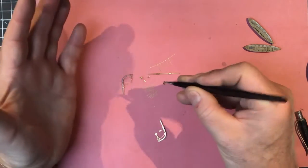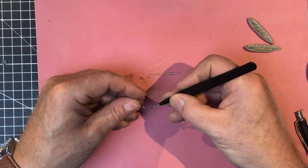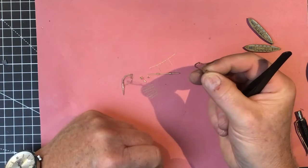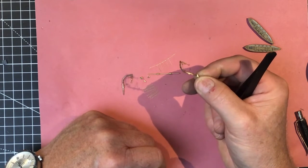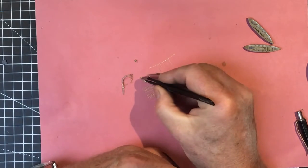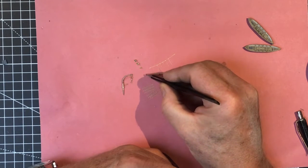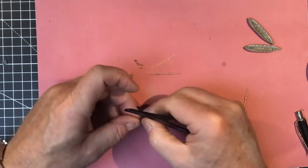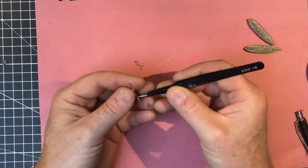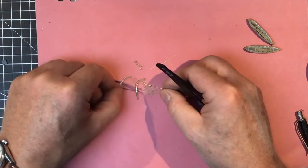Trying to solder this, it's a very loose, sloppy fit. So if I try and solder that and it just gets into the wrong position slightly, the davit's not going to sit at 90 degrees to the hull side. So we'll get into difficulties with that. And I'll get a good secure fixing with some super glue of these brackets to the hull and then just drop the davit in.